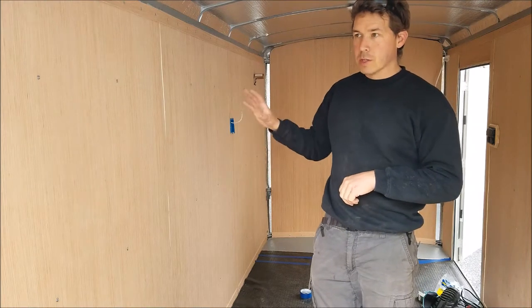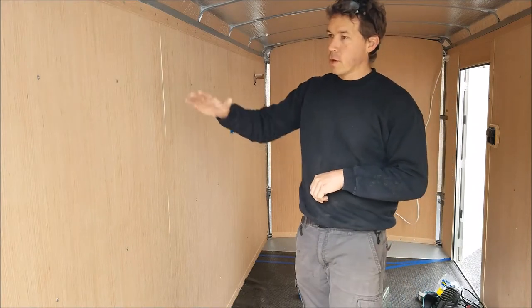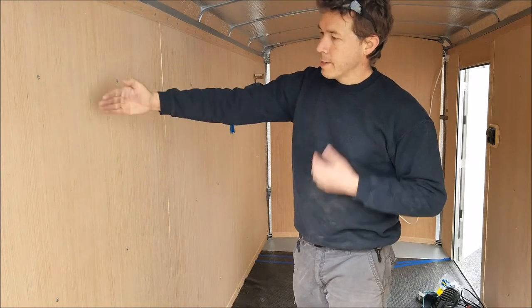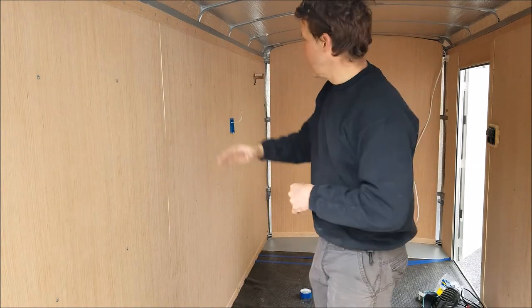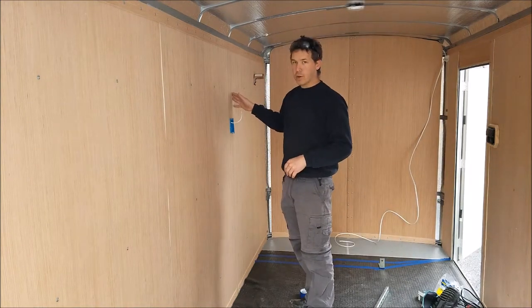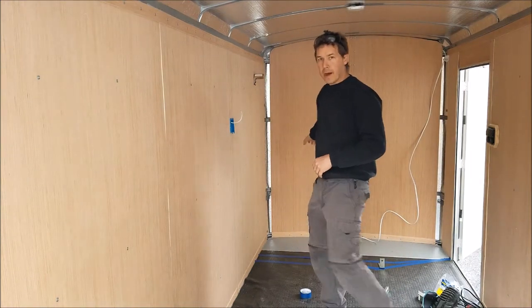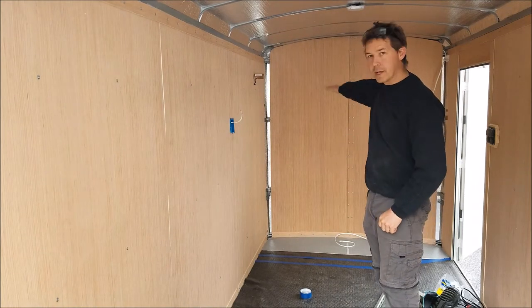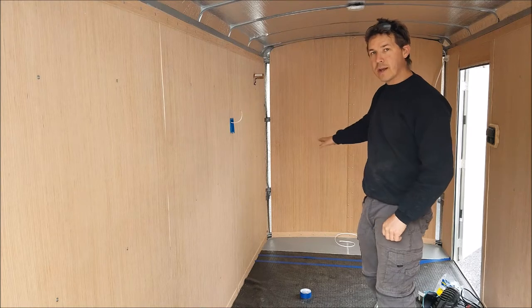What I'm going to do is put in all those smaller beds and shelves today. There'll be a shelf about 20 or so inches down from the roof, coming out from the wall about 24 inches, running most of the length of the trailer — about two-thirds. In the front, I'm going to put two beds: one low enough to be couch height and the other high enough so you can sit underneath it.